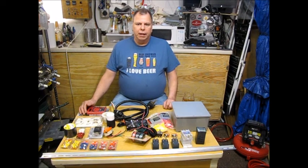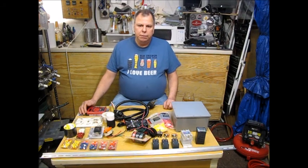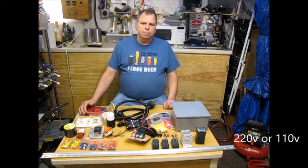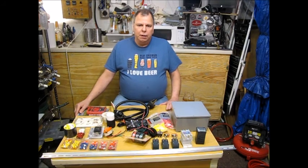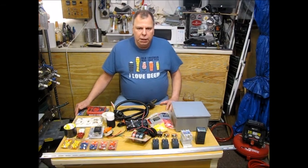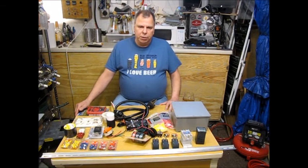It'll be a single PID and I'm going to set it so I can go either 240 volts or 120 volts on the outlets at will, but I'm also going to have a 120-volt outlet for my RIMS. So it'll be one PID supporting both outlets, with relays in place that'll switch power back and forth.